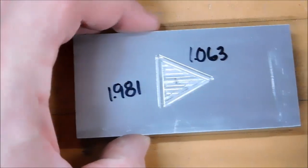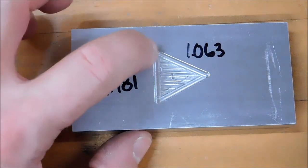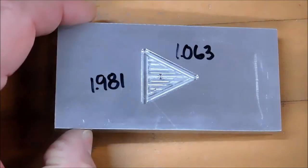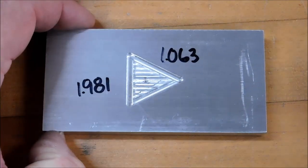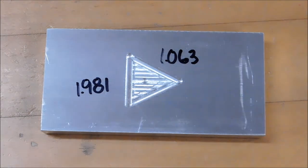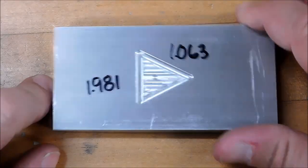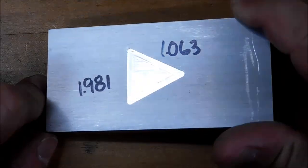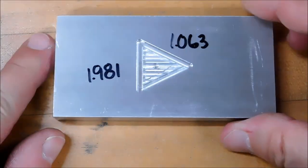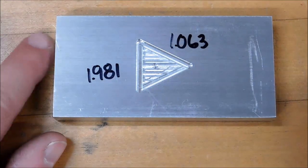Now the beauty of a precision setup is if you got to change anything, you can go back in. You can make the corners different, you can make it deeper, you can chamfer these, you can do whatever you want. But by working it out in the math, it only takes a couple of minutes. I know the demonstration probably made it look a little bit scary, but there's really no reason to be scared of it. If you have all the numbers on the print, you have pretty much everything you need to work with. There it is. It's a piece of cake. No scribed lines, no nothing. The layout time was coming up with two dimensions and a spot in the center, and we're good to go.